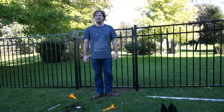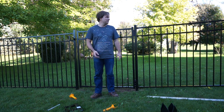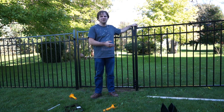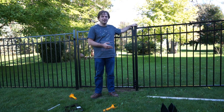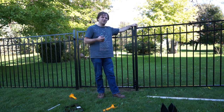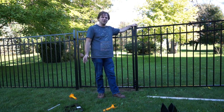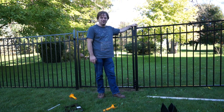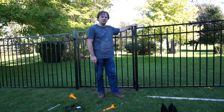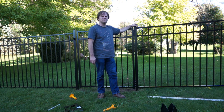That's over $1,000 in gates. In terms of installation, once I actually trusted the instructions, the post pounding went pretty quick. But attaching these covers and drilling into these galvanized metal posts — that took a lot. I went through several drill bits drilling the pilot holes. The screws they send are self-tapping, but even a self-tapping screw won't go into one of these heavy-duty zinc-coated metal posts without a pilot hole. When you use an eighth-inch drill bit, the fins of the self-tapping screw will often snap off in there, and then you have to re-drill the pilot hole and use that same screw because the fins are already gone.